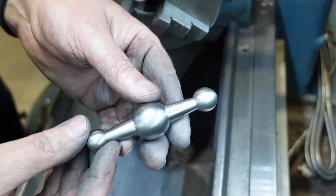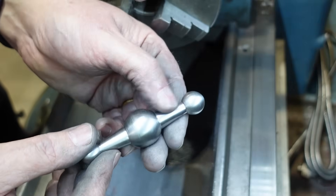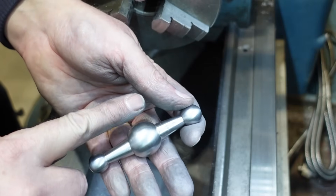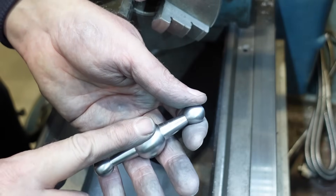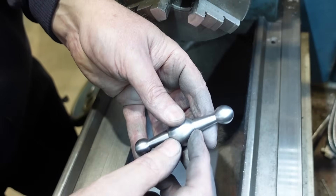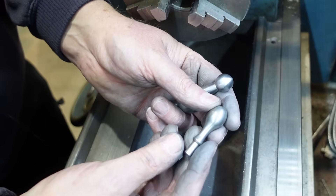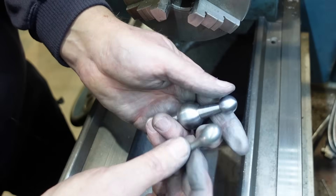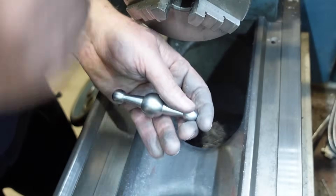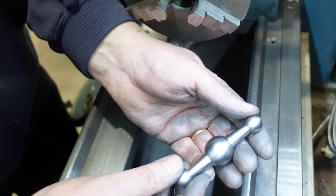There you have it — a three ball handle, or the basis of one. I've got a little bit of scuffing there from clamping the split bush, so I'll have to do a little bit of polishing. From here on it's relatively easy — I'll support it in a couple of V-blocks and come across the top to do a bit of a skim, bore a hole through for the spindle. There's an extension tube that goes on there and a handle in the end — you can actually buy these. That's a quarter inch hole handle that'll sit in there. So that's the basics of how you make a three ball handle. Thanks for watching, see you for the next one.